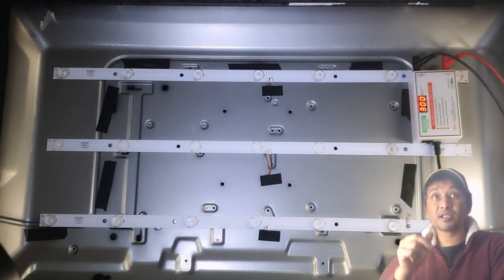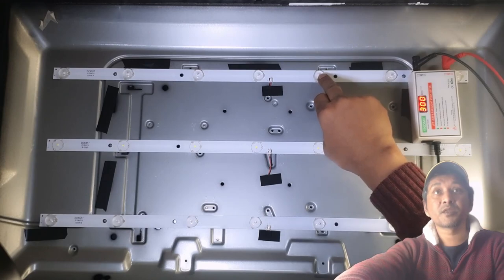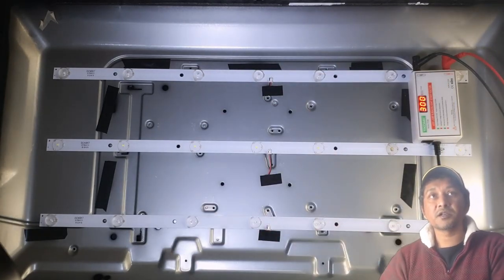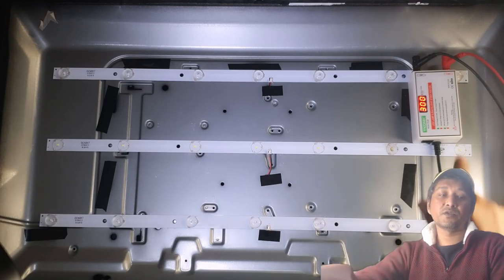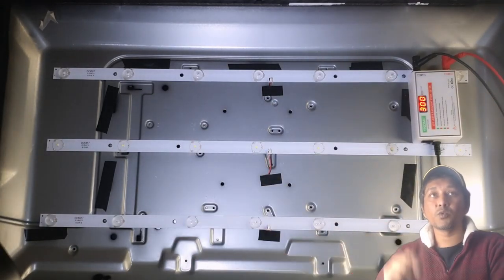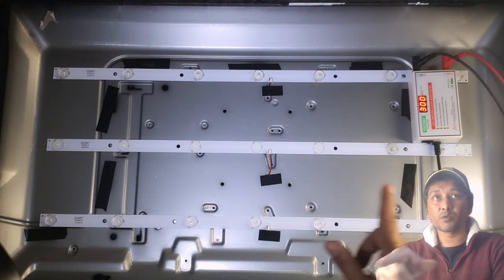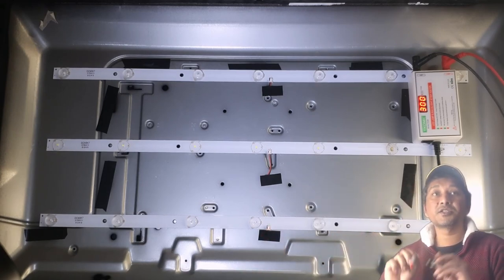Now remember, it's in serial mode, means if one LED is blown, all the LEDs are not gonna function because it's not in parallel mode, it's in serial mode. So for this to work, all those LEDs have to work. One is dead, means all of them are dead, because the circuit will not complete. Anyway, let's check